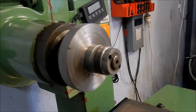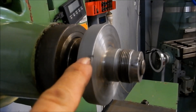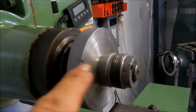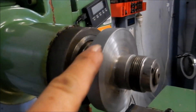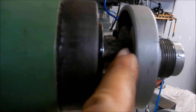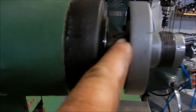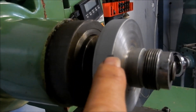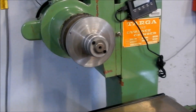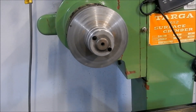If we can't move it we'll put a little bit of heat on it. It is on the left-hand thread so we'll see how we go with that. I have noticed a small little crack in here. This is actually hardened — it's probably around about high 40s, low 50s Rockwell. A file only just manages to touch it so this whole assembly has been hardened. Almost looks like it's been nitrided actually. You can see the crack lines up where the counterweight grub screws lock the counterweights into place. It looks like someone's been a little bit over anxious and done it up too hard, creating a tiny spread there. But before I start I've got to make up a small pin wrench to get onto here and we'll do this properly.